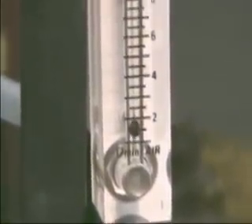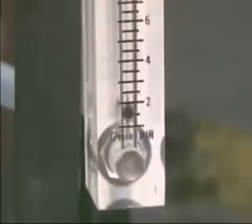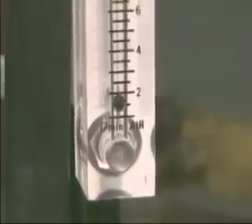We're focusing right now on the liters per minute through the flow meter. It's putting out about two to three right here. If we look at it closely — steady two, occasionally three, and here we're coming down. You can see the bubbles coming into the back pressure line of that flow meter. That's hydrogen coming out right there.